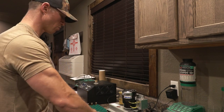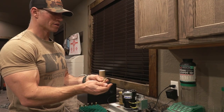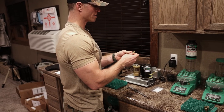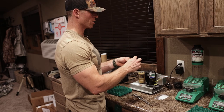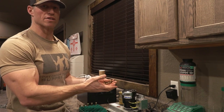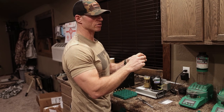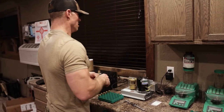This is the first time I've trimmed this Lapua brass after about four or five firings — and that's it. What I mentioned earlier about making everything the same — brass does grow, so you want to always continue to measure your overall length so you know if you need to trim. I trim mine a little bit shorter than what SAAMI says so that they don't have to be trimmed every time I reload. Every time I run the sizer die through and measure them, they're still uniform but underneath the trim-to-case length, so I don't have to worry about this step every single time.